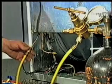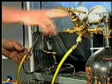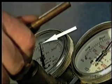Leave these stems out during the flushing process to provide greater flow through the system. The high side cannot take more than 250 pounds of pressure. Open the regulator until the pressure reaches about 200 — that's sufficient to do the job.